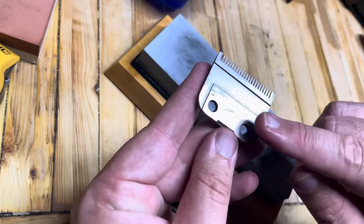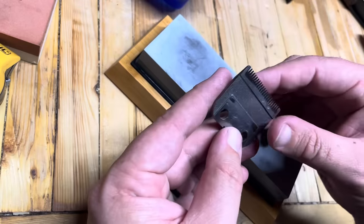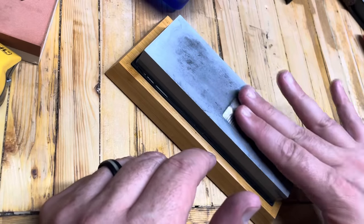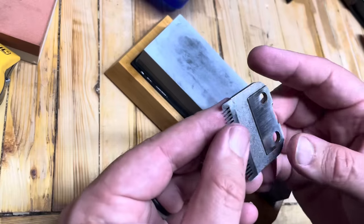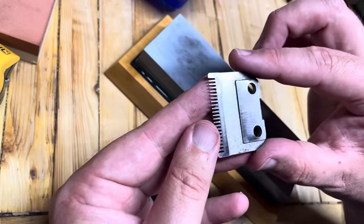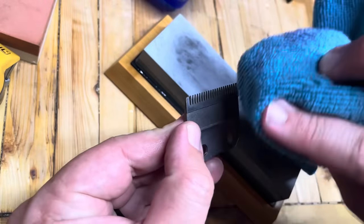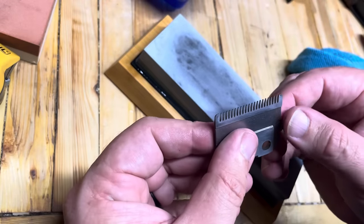This blade is a little bit bigger — it would be easier to do this if you had a big square of sandpaper, but we're going to make it work. Take a peek at our work — we see that this has smoothed off and it looks like we're touching all the way across. We'll go maybe another minute or so, a couple dozen strokes. Everything looks really even on there — that did very nicely. Let's move on to the 8,000 grit.